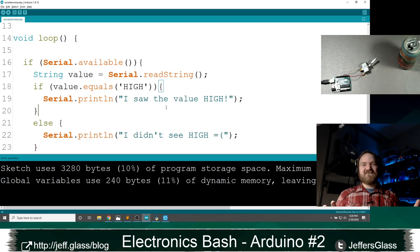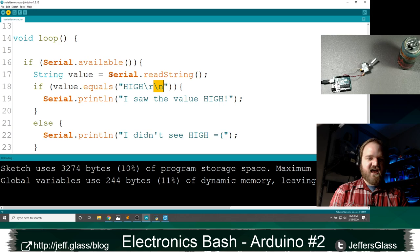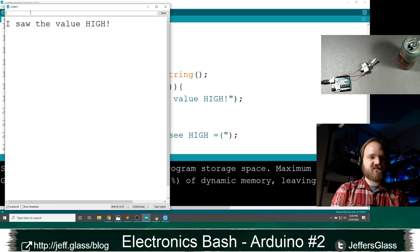New lines are included in the string, kind of says. Oh, maybe. Let's see, hi slash r slash n. This is the notation for the carriage return and new line character here. So our theory of operations might be that it's comparing to seeing exactly that. Let's try that again. It's carriage return, new line, and hi. Hey, there we go. Yes.